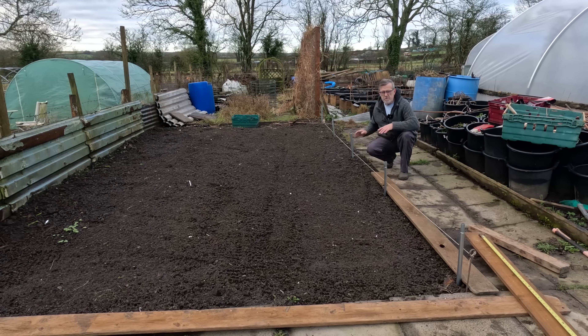When you get to the bottom you can three-four-five that corner again to make sure everything's right, and then measure across the corners. It's only really to get the rough placement at this stage - once we've dug the holes and are setting the tubes we'll measure again and be more precise to get it exact. Then once they're set, the rest of it just flies up nice and easy. So taking your time at this stage to level your ground and get your foundation tubes set correctly is vital. It may take an extra two hours, but it's worth spending that time to do it properly in the first place.